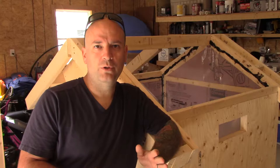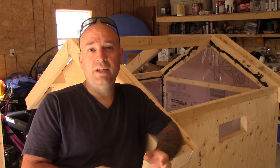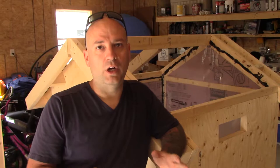I don't know if any of you are wondering about some of the holes. They looked a little soupy. You know, I may have gone overboard on the water for a couple of them, but overall that excess water is going to seep into the ground, and the concrete will set just fine. If anything, in this heat and this sun, that extra bit of water will slow down the curing process a little and probably end up with a stronger concrete than if I had less water in it, because concrete is not good if it dries too fast. You want it to cure, and the whole chemical process to take place is not the actual drying which makes concrete hard and sturdy. So as long as all that takes place, we're golden. And for the purpose of a swing set, whatever that concrete turns into is going to be just fine.